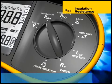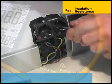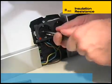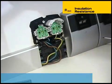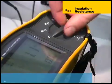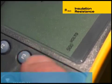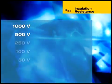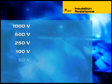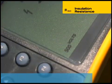The integrity of insulation is critical for the safety of electrical installations. To test the effectiveness of insulation, its resistance must be measured between all live conductors and between each live conductor and earth. The test is performed by applying a voltage across the conductors and measuring the current flow. The 1650 directly displays the insulation resistance. The 1650 series generates selectable test voltages of 1000, 500, 250, 100, and uniquely for an installation tester of this type, 50 volts. A lower voltage of 50 volts is generally required for testing telecommunications installations.